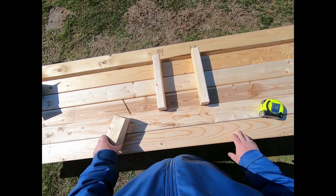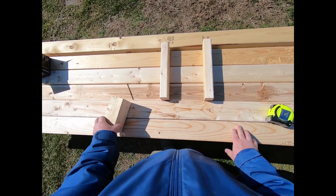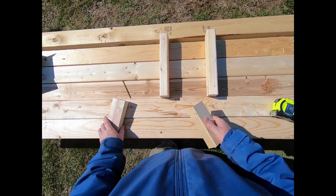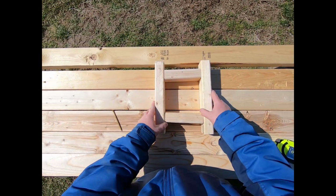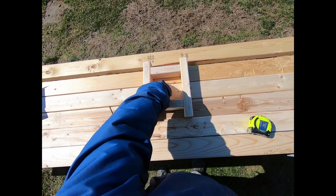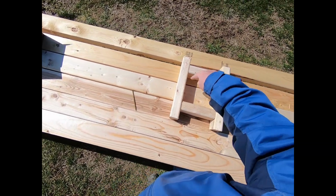So I'm on a good work surface. I'm gonna go ahead and build my frame for my smokestack that comes up into the floor. So I got 2 11 3/8 inch long pieces here. They're gonna go in between the joists on the flooring. Then I'm just gonna box them in like this. Center that. And my smokestack will come up through this. So I'll put my flooring on over the entire thing and cut the hole out when I'm finished.